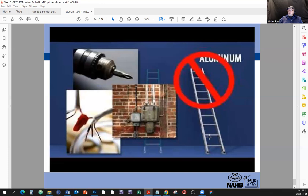And of course, when you're working a lot with electricity, while you are working on wiring and all that, panels and stuff, of course, the whole power should be shut down. But we are preventing accidents from happening, and accidents are not planned. So what if somebody turns the power on by accident somewhere else, what if there is something that you're not aware of from another electrical panel that you think the power is off, but maybe there's something there. So it's trying to eliminate any kind of a chance. And the more you eliminate as far as chances for accidents, the safer you are.